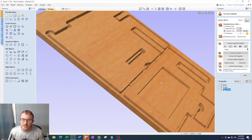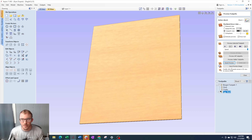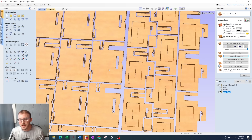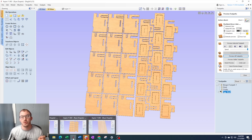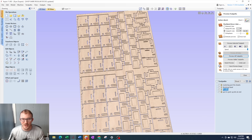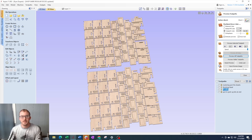What it would do is leave a tiny little layer so whenever the bit came by on the second pass and cut it all the way off, the parts didn't move much. As we started growing, the tool paths got more complicated. When I got my four by eight foot CNC with a vacuum table, I didn't have to use as many tabs. My bits got a lot faster — I went from 100 inches a minute on the profile toolpath to 340 inches a minute, all at 18,000 RPMs. Then we grew even more. After a couple years cutting 15 at a time — that toolpath took about 45 minutes — we bought the ShopSaber five by ten foot where I can fit two full sheets.